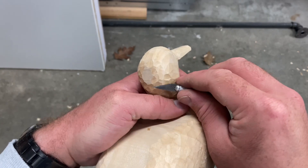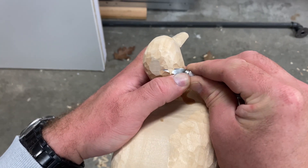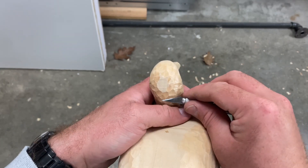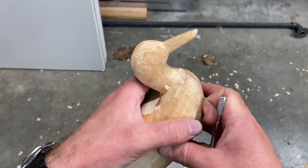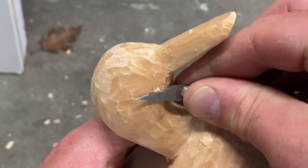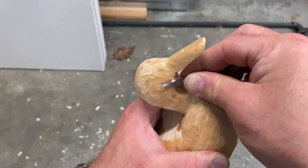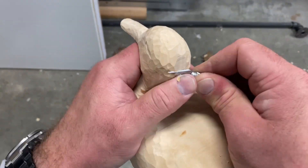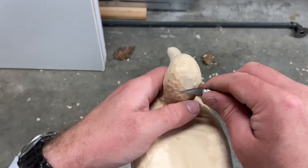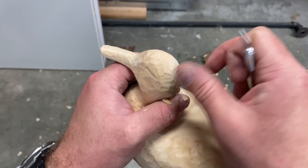Eventually you'll reach the point where you need to do some more detail work and the utility knife will become too big and awkward, especially in tough areas like around the base of the neck and around the beak where you have to carve curves. Normally you'd use gouges — curved chisels — if you were a serious woodcarver, but I'm going to show you how to do it with an exacto knife. The smallness of the blade lets you get into tight quarters and make pretty decent curves. Exacto knives are easy to find, and when they get dull the blades are easy to replace. You can see I'm really starting to get a nice rounded look to the head thanks to the detail work with the exacto knife.